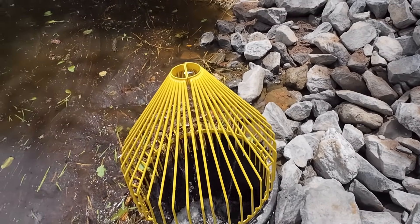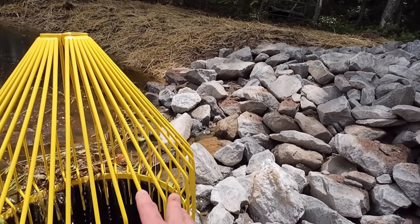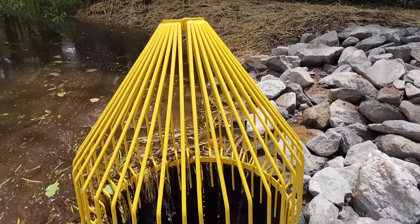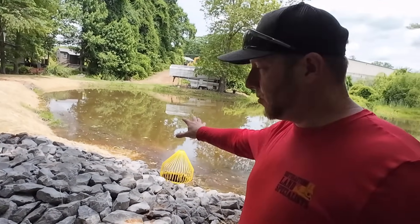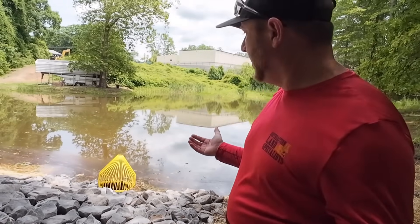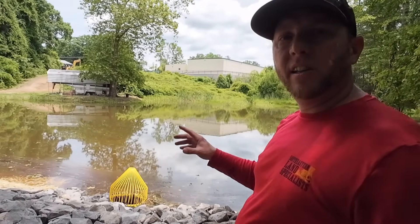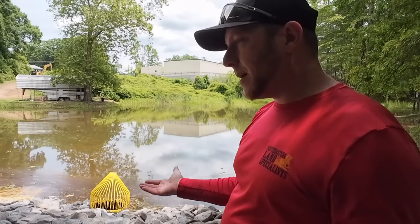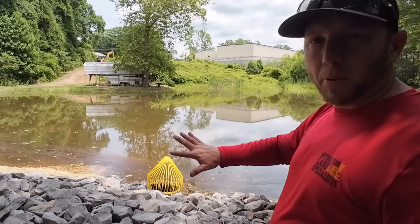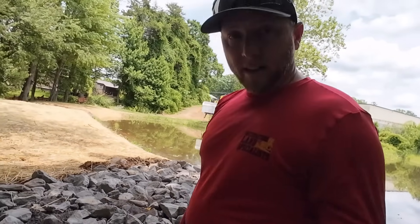You can see we did in fact have just a little bit of lean here — from that side to this side there's only about a half inch, but that's enough to lean it over. If it were perfectly level you'd see water running in all the way around it. The reason it leaned is I wasn't able to drain this whole pond down at all — I used that poly seal, which is a real rubbery seal, and I wasn't able to pack the dirt as well on the far side of that rack. Water came in, softened the soil on that end, and it's putting a little bit of pressure on it — but it hasn't moved enough to damage that seal.